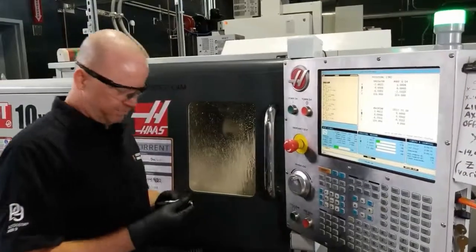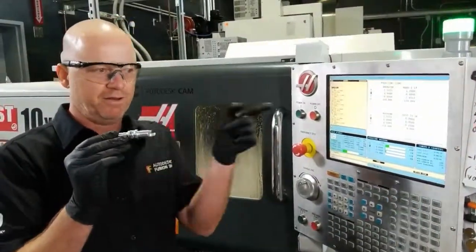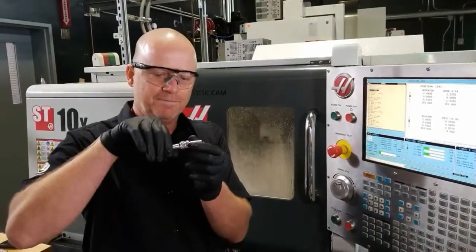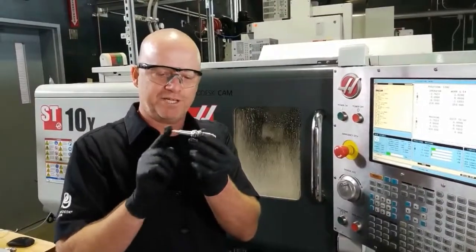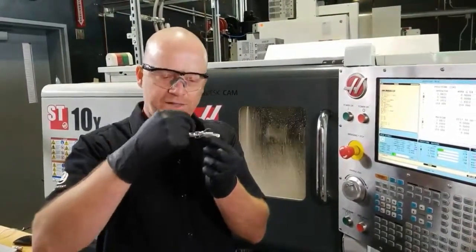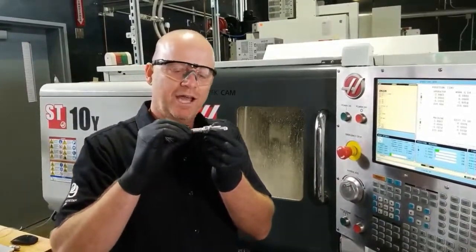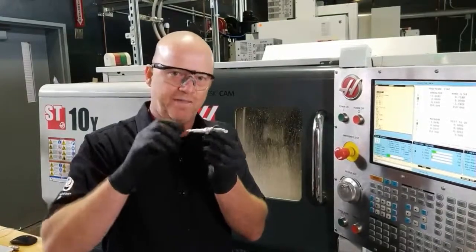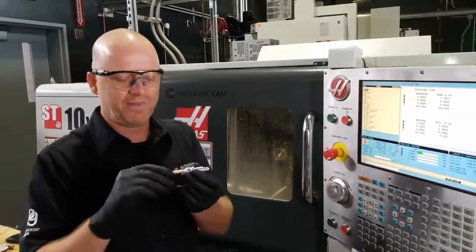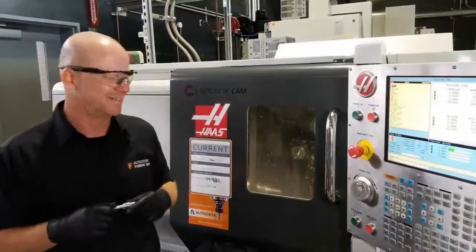All right, so now we finished all the work in this front section, and this is all solid stock. So now what we're working on is this portion here where my finger is, and we're going to machine all of that, rough it out, and then finish. And then we're going to leave this still rigid and solid, and then we'll do it in another segment and work on that. That's a technique I use because obviously if you were to turn all of that, this thing would be flapping in the wind, and then the finish pass wouldn't be ideal.